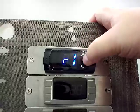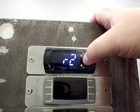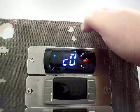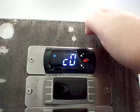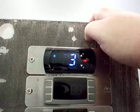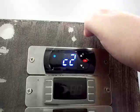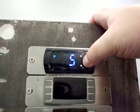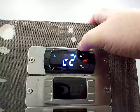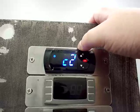R1 is the minimum set point. Since this is a freezer controller, the minimum set point is negative 10. R2 is your maximum set point — for this freezer controller, the maximum set point is 5. C0 is the compressor and fan delay after a power up — basically the wait time from powering the unit on to when the compressor actually kicks on, and that's a 3 minute delay. C2 is the minimum compressor off time, normally set to 5 from the factory. If the unit reaches its set point and then goes above the temperature differential within a 5 minute period, it will wait the entire 5 minute period before kicking back on and cooling down.